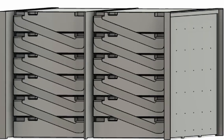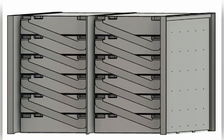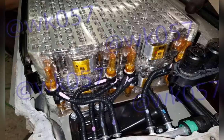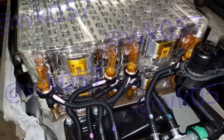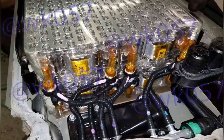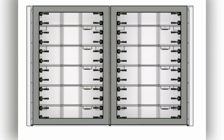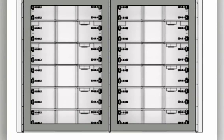Here's what a stack of 12 would look like in the box. The three sides — the two sides and the middle — will all be welded solid. Then I'll just bolt on the front, the back, and the top. The only thing coming out of the box will be the wiring and some coolant lines. Each 100-kilowatt module has two coolant loops per module, instead of the earlier modules which only had a single. So there's parallel flow to each of the loops all the way throughout the car. Each box will have its own manifold, with four connections per module and parallel flow in and out.